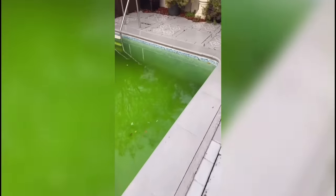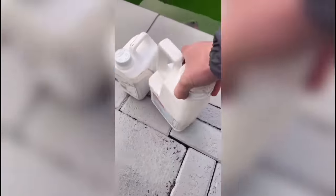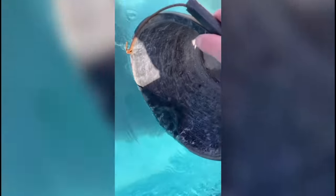Come to this pool - this guy's been away for a couple of months and his pool's gone a bit green. Get flock and shock out straight away, sprinkle the shock in first, then get the flock and sprinkle that around. Get the brush out, brush the whole pool disturbing all the algae. Quite a few leaves in the bottom. Come back tomorrow - and here we are, nice and clear literally the next day.